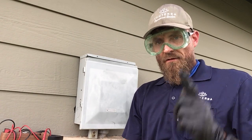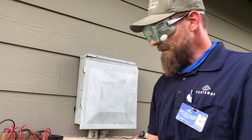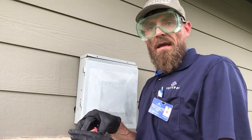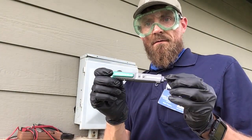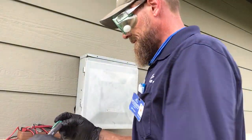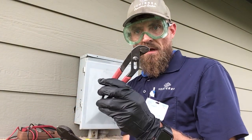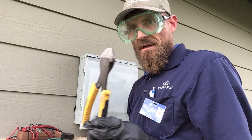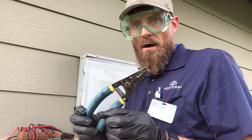Let's go over a few things we're going to need to get started today. First of all you're going to need PPE — gloves and goggles for sure. We're going to need a multimeter for AC voltage, or you can substitute with a hot stick. A couple of hand tools we may need are channel locks to remove the nut, a pair of cutters to possibly cut some wiring, and last but not least we're going to need some strippers if we need to strip back a new set of wire.